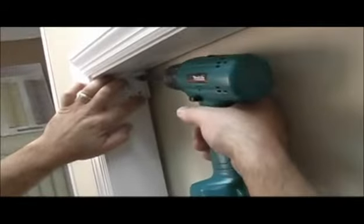What we're going to do right now is install the shade as an inside mount — meaning inside the window frame. Take the mounting bracket and face it so that the L portion is facing toward the window. If you have a screw gun handy that's great, it'll make things move along quicker, but you can always put the screws in by hand. Take the bracket, put it up against the side of the window frame and push it all the way up to the top. If your shade is very long and the roller is a bit thicker, you might have to drop it down a little — that's why we've slotted the bottom bracket, so you can move it up or down. We're going to mount this flush to the top of the frame, put the first screw in the top and the bottom screw in the bottom. That bracket is now in place, and we do the exact same thing for the right side bracket, so we have our two brackets in place.